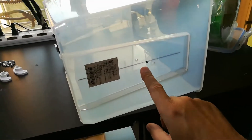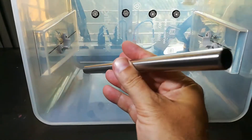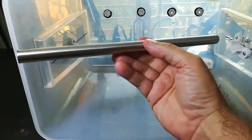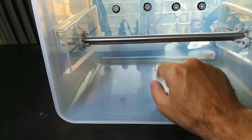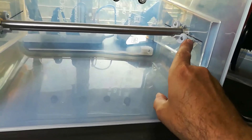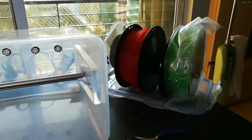We've got the four filament holders in place with a rubber washer on each side — purely for a humidity block. I'd recommend just finger tightening them. We're not trying to make this waterproof, and they definitely snap off if you apply too much torque. If you really want to crank these down, use a different material than PLA for better results. The brackets are in at a slight angle in the front to keep them from falling out. I bought a piece of stainless steel bar at the hardware store — part of a towel rack that cost 200 baht, about $6.50 — cut it down to size, and it fits the brackets perfectly. For the two holes drilled in error, I just ran a bolt and nut through them to keep them airtight.